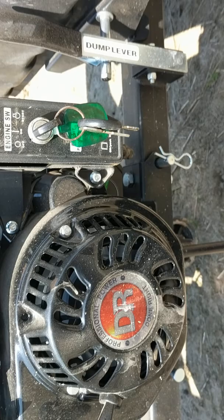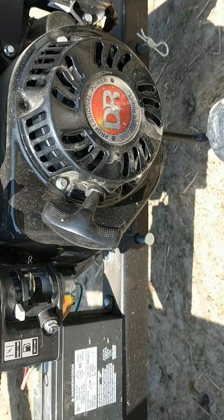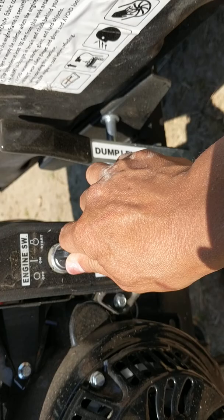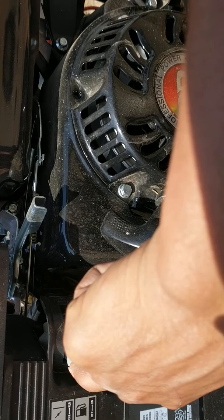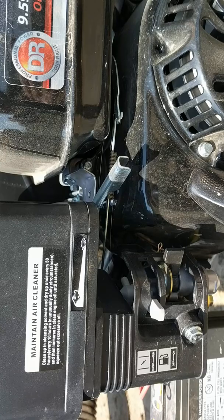The first thing we're going to do is turn it on. I do have the electric start for this but we haven't hooked it up yet, so for right now we'll just use the on position over here. Flip the gas to on, choke it so we can get it started, and here's the pull handle. Then once it's running, you'll turn this up for more suction power.